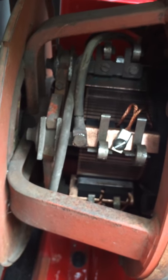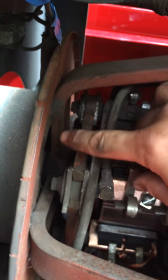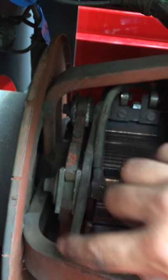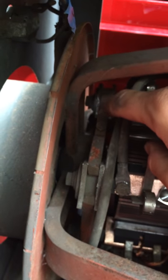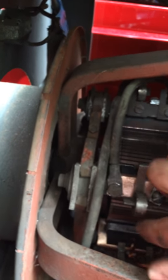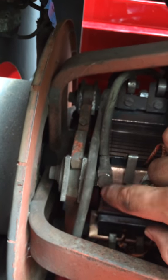To adjust your OCVs, there's a term called rolling the rack — bumping it to the cab. You loosen this 7/16" bolt right here in this rack that holds all of your brushes and brush holders. If you roll it counterclockwise, it will make your OCVs cooler. If you bring it toward you, it will make them hotter. Mine happened to be at 1550 RPMs with 97 OCV, which is incorrect — it will burn up your tools when you're trying to use them.